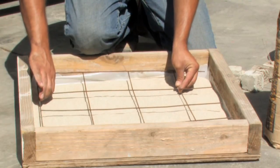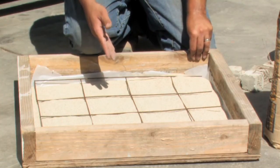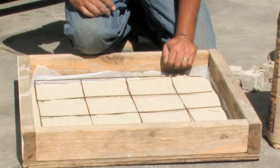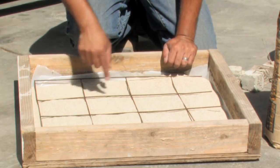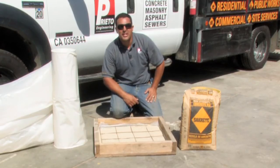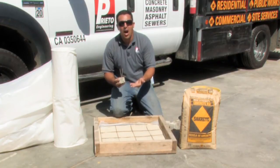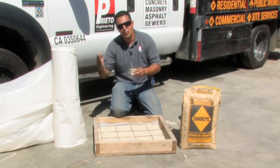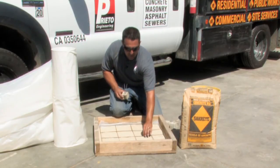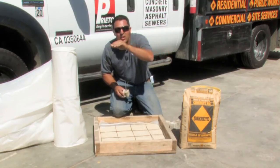Place the wire mesh into the interior of the home. If using wire mesh, you'll want to ensure that you have at least two squares of lap for a six-inch by six-inch square mat. Following the placement of the reinforcement, you'll want to raise it off of the sand so that concrete can go below it and over it. Typically, you'll want to have the reinforcement at the mid-level of the concrete.